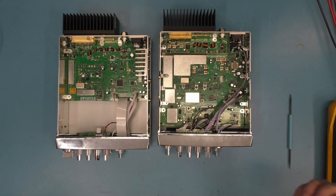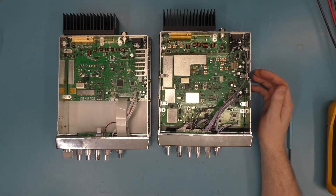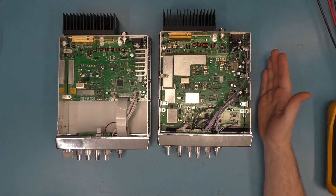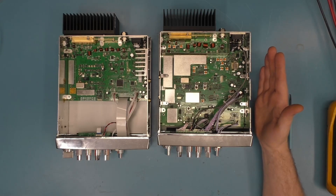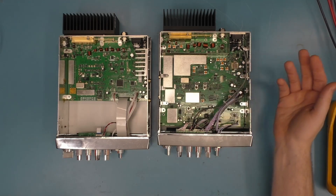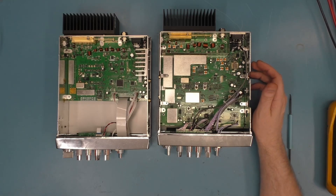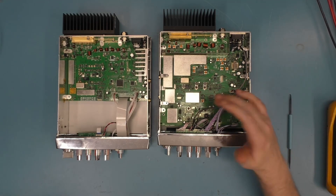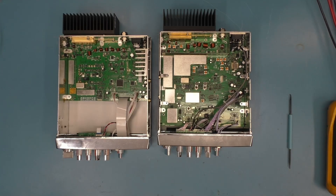There's version 2 and version 1. Version 1 is tried and true — it's a robust platform — but the whole issue really is parts. They're getting harder to find. A lot of the parts this was originally designed with are obsolete, haven't been made for years. Varactors used for the filters are unobtainium, the PLL is pretty close to unobtainium, and the microcontroller is over a decade old. This is essentially an over-a-decade-old design.